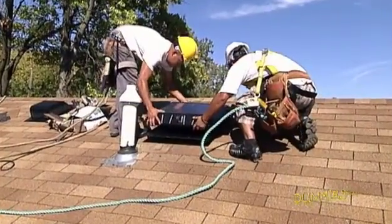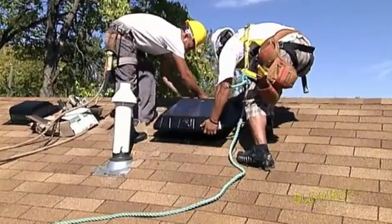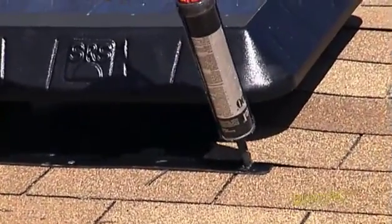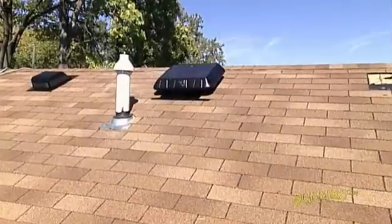Next, while you're on the roof, pull the shingles back and slide the unit, including the flat base, up under the shingles. Drop the fan into the hole. Seal the fan base with silicone or ice and water shield tape for weatherproofing. And you're done.